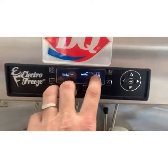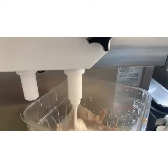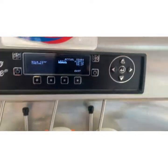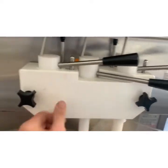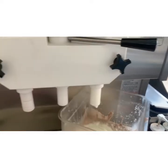Literally a minute and a half later we're at 25 degrees. This is air in the system — starting to get ice cream. This is why sometimes in the heat of the day this thing would work: when it got hot enough outside, that valve would unstick on its own.